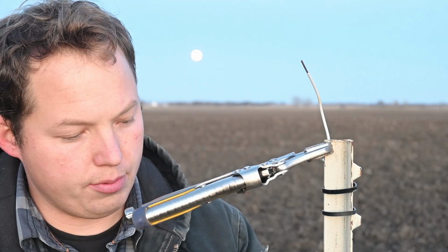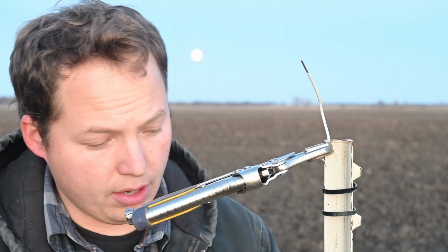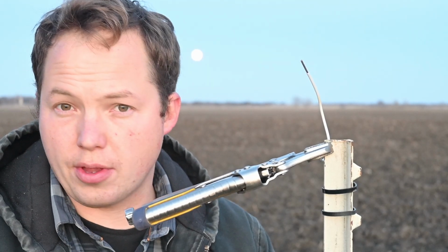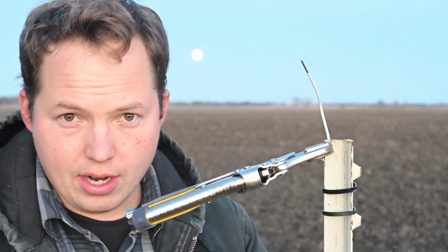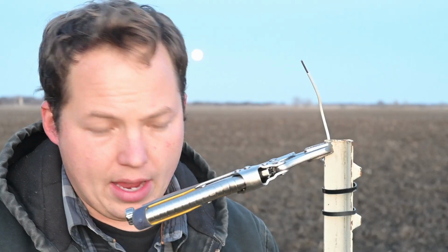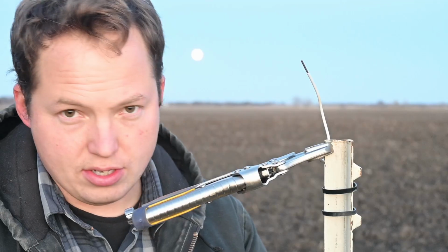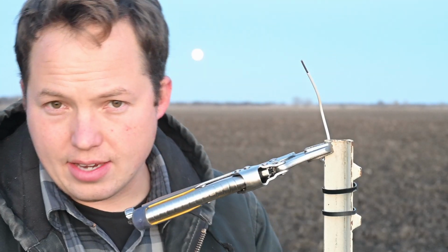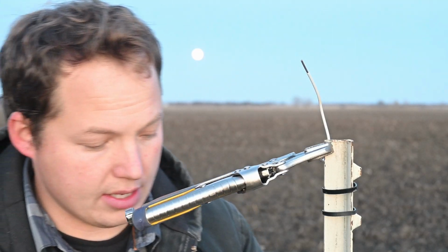I'd be really interested to know if you guys have done anything with single wire earth return systems before. This is something that's actually used in certain parts of the world, surprisingly, or in certain situations where they're trying to get power to an extremely remote area. Because obviously a single conductor or a single wire going out to a location is going to be way cheaper than having to run multiple conductors. So it's got definite downsides, and you would never really see this used in the situation that we're using it today.